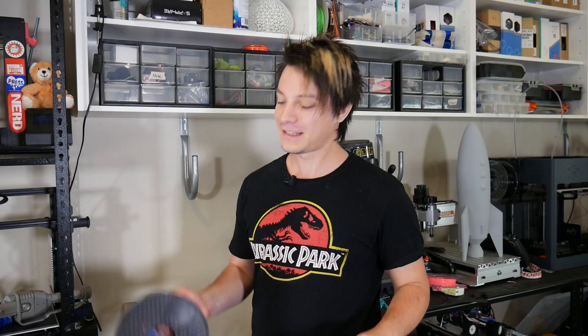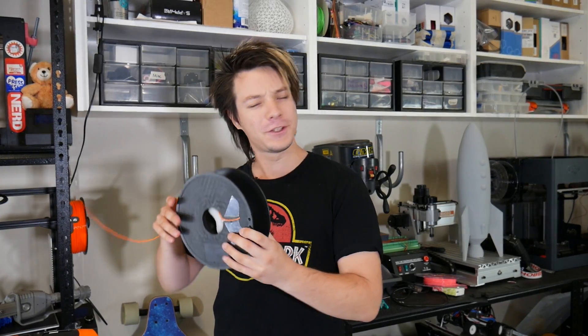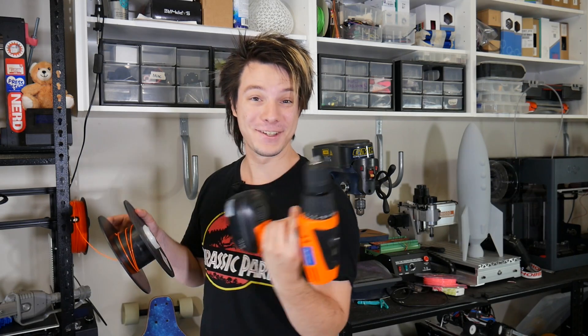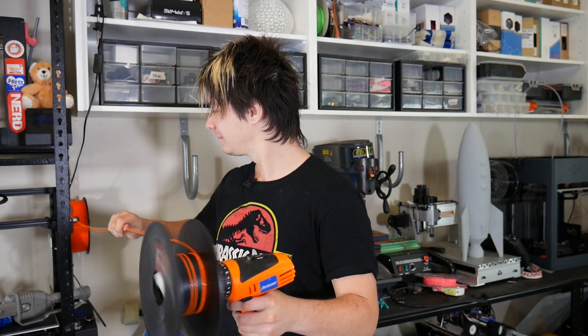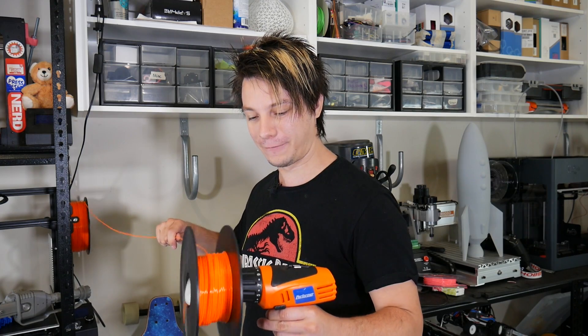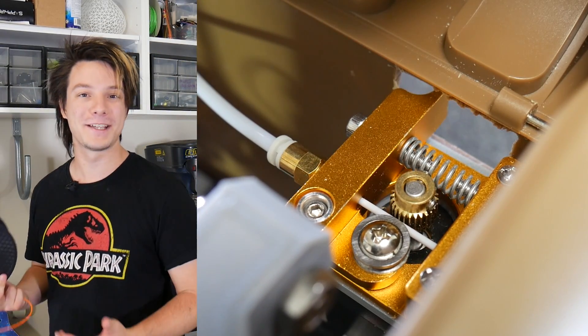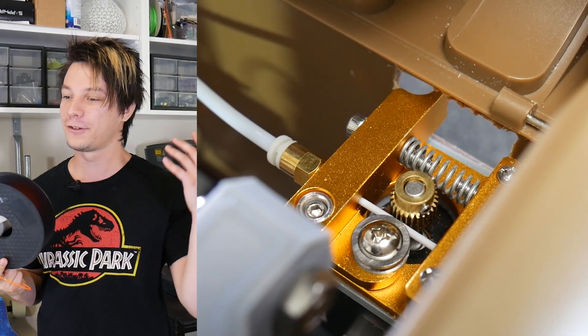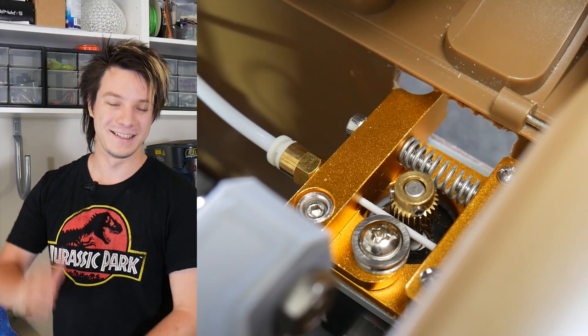One bonus tip: sometimes you want to transfer a spool onto an empty spool — like if you've got a cool color you want to share between printers running at the same time. Tape the inside of the full spool to the empty spool so it doesn't come loose, put the full spool on a holder, give it a few turns by hand to get a few winds on it, then get a cordless drill with a bit of foam inside the spool so it's tight on the chuck, and automatically wind the filament across. Thanks for watching — I hope you enjoyed this video. My aim on Maker's Muse is to empower your creativity through technology. Hopefully you'll manage your filament a lot better and avoid those annoying tangles. If you enjoyed this, please subscribe — catch you later!